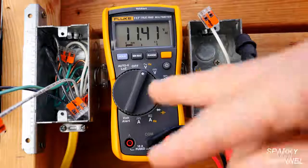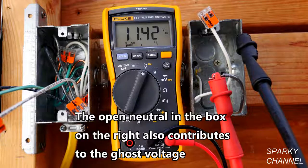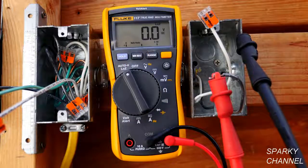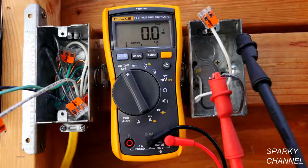A ghost voltage is interaction between different wires. You've got non-conductive and conductive wires and they interact and create something called capacitance, and you get a ghost voltage. It's a real actual voltage, but for many basic applications it is considered a false reading. So you turn it to Low Z and it reads zero — this is a useful setting for determining if there's electricity in a circuit. If you want to reduce the possibility of a false reading, you put it on Low Z.